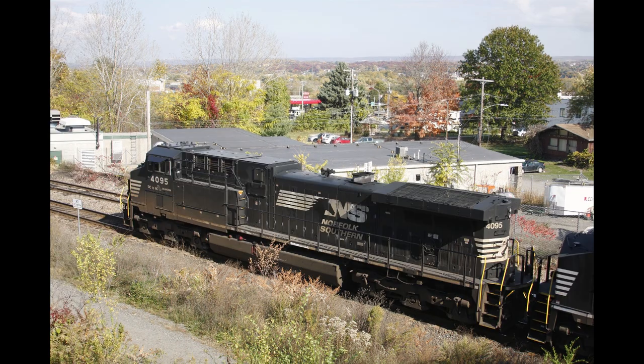It's a dramatic comparison that Hammersley needed new crankcases on their GEs, while BHP Billiton was putting 40-year-old SD40s into service with their original crankcases still in them. And keep in mind that I'm talking about SD40s that clearly put in work on the grades of Tehachapi, Donner Pass, and Rio Grande's Rocky Mountain lines, including the Soldier Summit, because like I said, cracking was a problem with many GE FDLs.